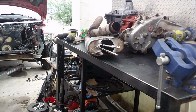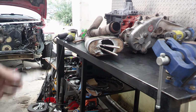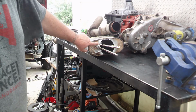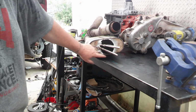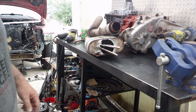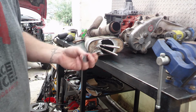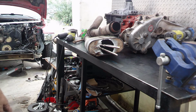So this is going to end up being more like plastic surgery than welding, but I'm just taking some scrap pieces of metal that are about the same thickness as this muffler, but you can see where it's got some stress fractures in it, and of course it's got some damage up here where it's been smacking on the road in the bottom. So stress fractures over here as well. So I'm just going to add these in there to help it out a little bit, hopefully. Should work.